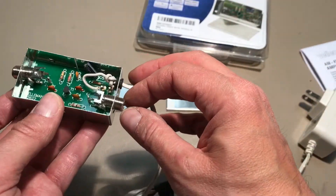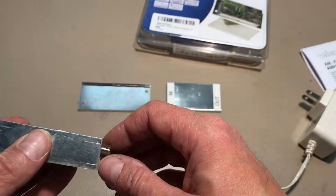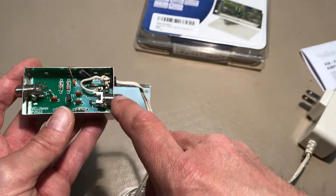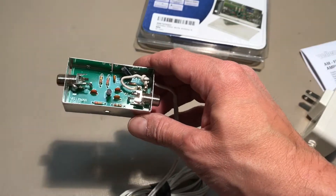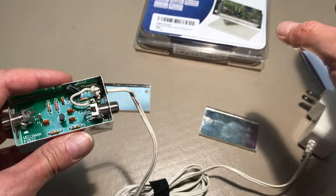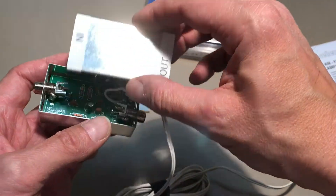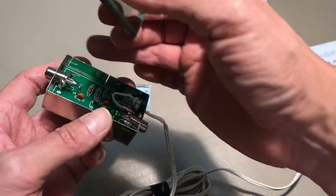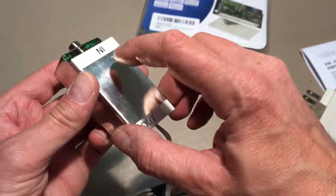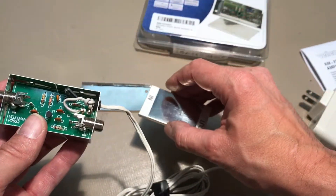I also shifted the jack positions a little bit so they fit the finished enclosure much better. The board itself tells you what the input is and what the output is. The input is going to go from the antenna you're trying to amplify, and the output goes off to your radio. Since you're not going to have access to the board once it's assembled, it's a good idea to mark right on there with a Sharpie — or I used my little label maker to make it look nice — what the input and output are.